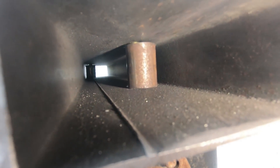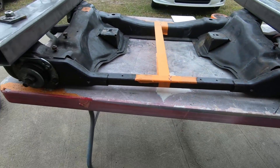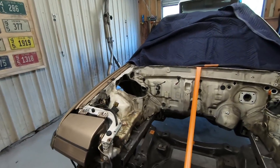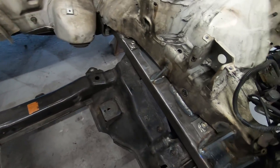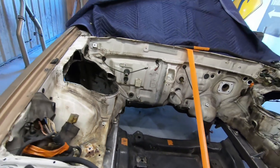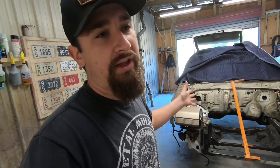I think the laser I used in the last video threw me off because of depth — if you're not perfectly on it, the laser hits in one spot and then another spot, so it looks level but isn't. Now that's out and it looks good. A bunch of people suggested putting a solid rod where the bolt goes through, so I went ahead and did that. You can see that little rod right there — it's leftover pipe from when I built the cantilever suspension setup, thick stuff, perfect for the bolts to go through. I'll weld that in from the top once everything is set. We also put in some gussets here and there, and then we're going to plate everything out to make sure it's really strong.